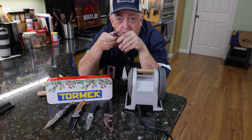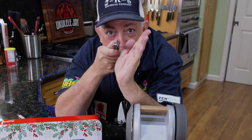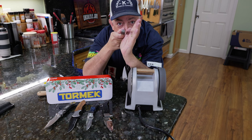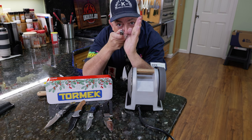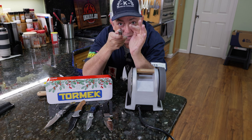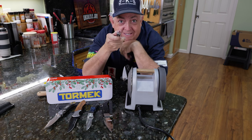If the marker is removed from the very bottom, the angle is too shallow. If you're getting the top of the marker removed and not the bottom, your angle is too steep and you need to open the angle up. So we'll start at 20 and adjust — I have a feeling it's going to be greater than 20. Let's take a look and see.